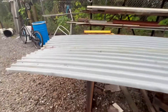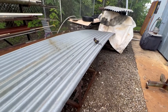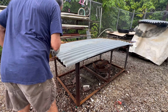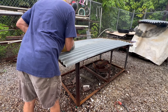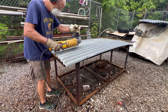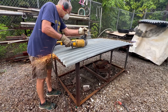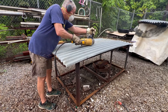I've got the first two cuts marked. I'll use the big grinder with a cut-off wheel - it's not going to be a pleasant thing but we'll cut it. I don't know what gauge this metal is, but it's not going to be cut with tin snips - this is not Home Depot metal, this is real old school sheet metal. The big grinder cut it pretty well. I didn't go in a perfectly straight line but not a terrible line either. Afterward I put a flap disc on the grinder and eased up all the gnarly edges so I probably wouldn't bleed quite so much.